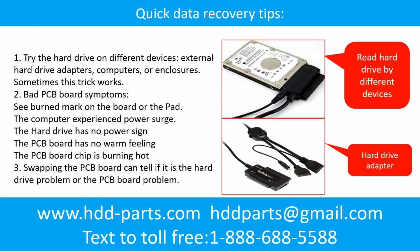There are some simple ways to recover data from a hard drive. One of them is to try to read the hard drive with different devices, like different external hard drive adapters, computers, or enclosures. Because different devices use different ways to read a hard drive, sometimes this trick works. Another way is swapping the hard drive PCB board. Swapping the hard drive PCB board can fix the problem caused by the PCB board. There is a cost in swapping the PCB board, but it is way cheaper than sending the hard drive to a data recovery firm.